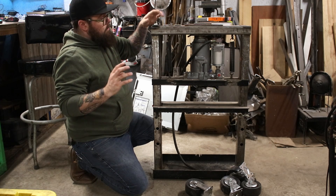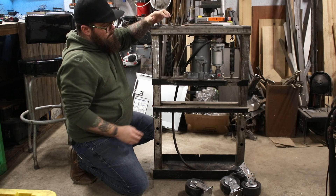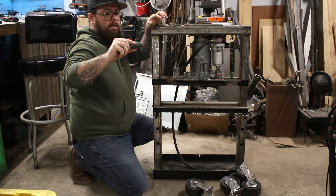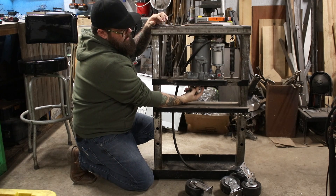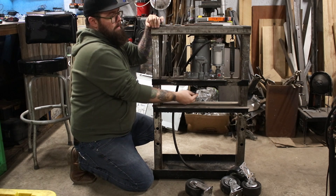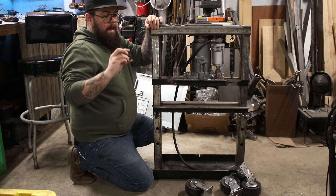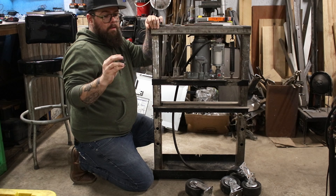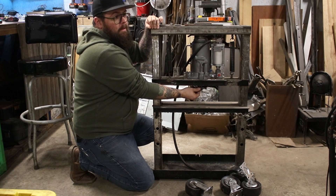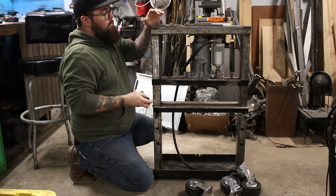All that's left to do to get this ready to use: I've got some end plates for the end of this tube here — that's purely cosmetic to close up the ends. For attachments, I've basically got a one-inch grade 8 bolt with the head cut off. There's a nut welded on the underside below the jack in the center and it just threads in there. Since this bolt's bottomed out on the bridge, the weight's going to be transferred to the body of that bolt and not the threads, which should handle it anyway being one-inch grade 8.